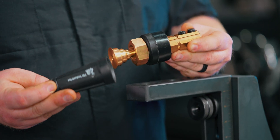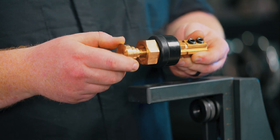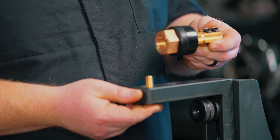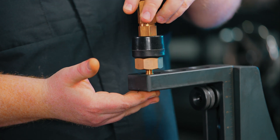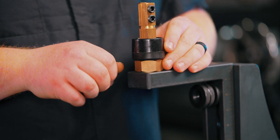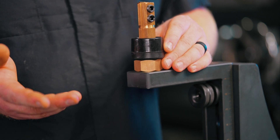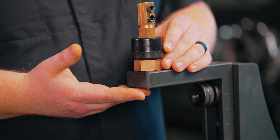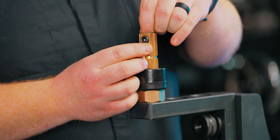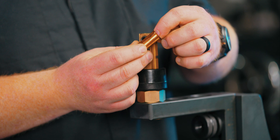This is what's going to come in the packaging for the grounding connection — it's very simple to use. We're going to put this boot on in just a little bit. First we're going to thread out this stepped bolt. We can install it on either side of the table, then we're simply going to thread this on. Of course you would want to use a wrench and really tighten it down. You can use an adjustable on the nut, then use the included six millimeter hex that comes with the Sigmund 28 tables to tighten down the flush mount bolt. There are two six millimeter hex set screws that are going to bite into the copper lead from the welder. This does include an insert copper piece that helps on softer wire to crush and make a good connection inside of the brass.